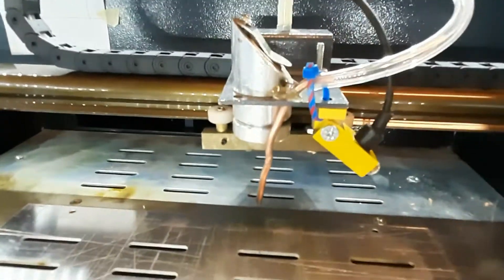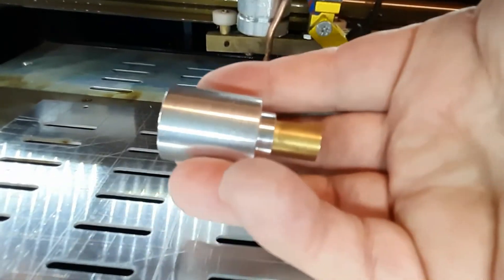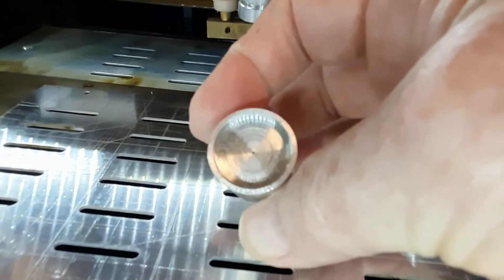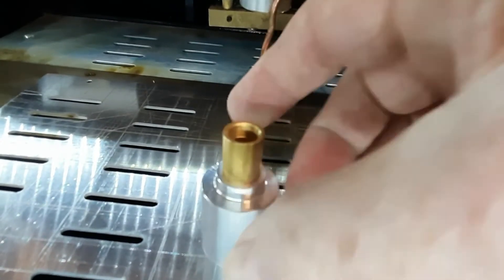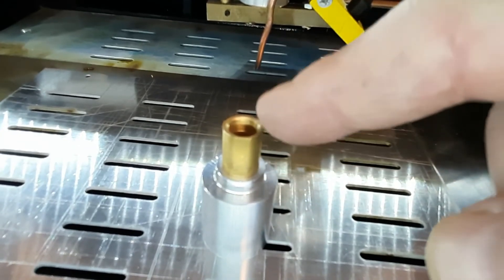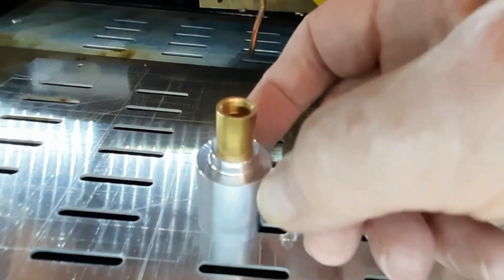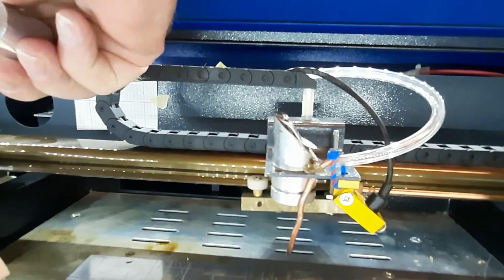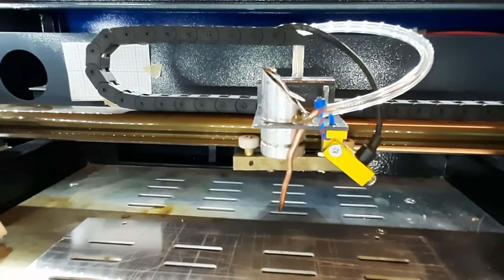What I have here is the American Photonics alignment laser. They've machined a billet section threaded to screw onto the bottom of the standard K40 head, with a hole in the middle. On the other end is a laser powered by three button batteries — or you can do a bypass, which I posted about. When it's on, it shoots a beam straight up into mirror three, from mirror three to mirror two, and mirror two to number one. It cuts down on your alignment time dramatically.